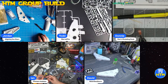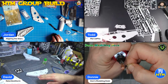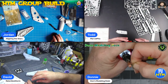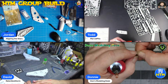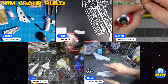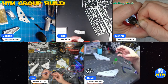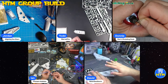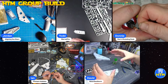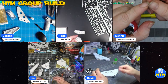It has more to do with how the enamel and stuff flows, because it's always going to try to level itself out. With a flat varnish, think of a really rough texture, almost like the top of asphalt or concrete. If it's rough and you pour water onto it, it wants to go out, finds all the cracks and goes in all the different directions. Whereas with a smooth glass top, you pour the water on it and it just sits in one spot. The capillary action of a rough surface wants to pull the material out, so you get a staining effect. Whereas if you have control, because it doesn't want to move on you, it just goes where you tell it. You can control it in streaks and lines much easier.